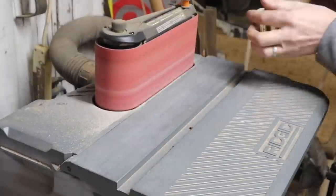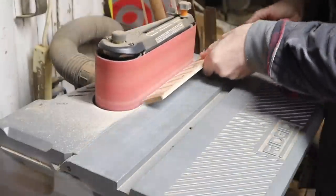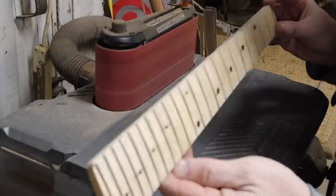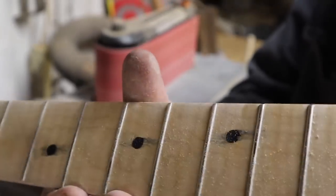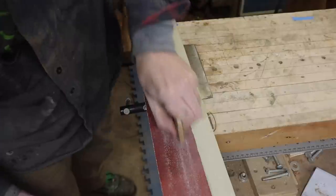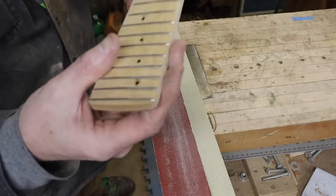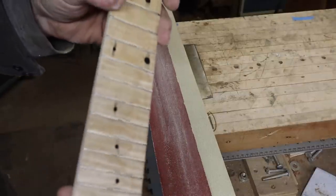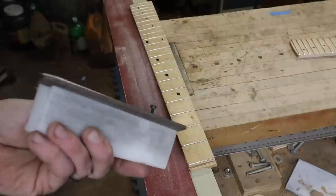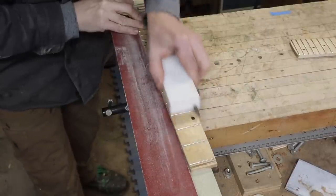For me it's just a lot easier to get the frets in while it's all nice and flat like this. Then on the neck I use this belt sander to quickly file down the rough ends of the frets and also put a slight bevel on all of them at once. I do it by eye, very carefully — you can very easily screw up all your work at this point, so this is not for the faint-hearted and it takes practice. A much safer way for a million reasons is this flat sanding block — a piece of sandpaper stuck to a flat piece of wood. The sanding surface spans the full length of the fingerboard so you're not risking uneven sanding. This is also a tool I made that helps you put a bevel on the edge of the frets — they sell these things and they're very expensive, but all I did is cut a slot at a slight angle and stuck a regular old bastard file in there.